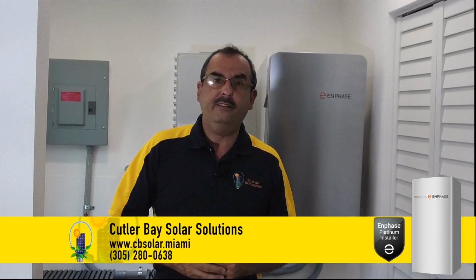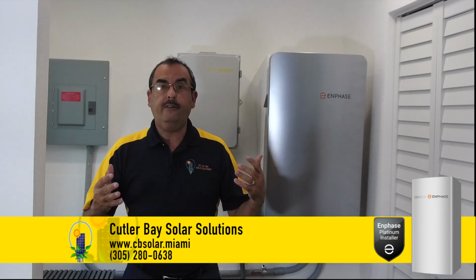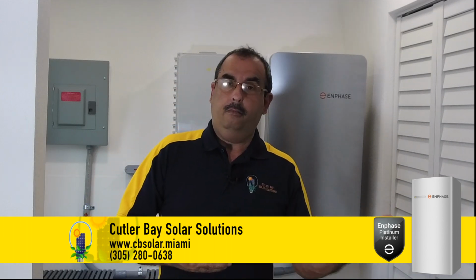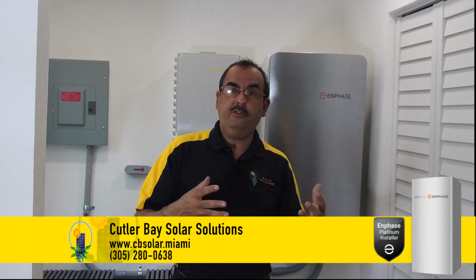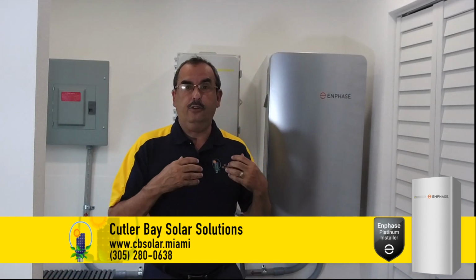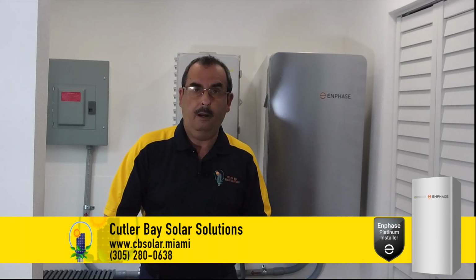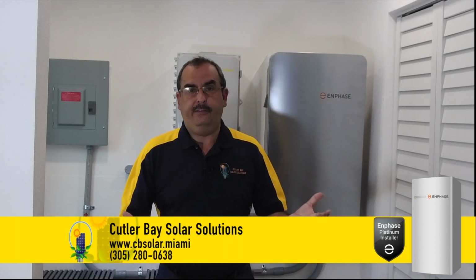These are two amazing systems. Let's get right into the first difference between them. And the first difference between them is the way that they are cooling. The Tesla PowerWall 2 has mechanical cooling. They have fans to maintain the chemistry, and those fans have to be powered in order to cool down the battery. While the Enphase Ensemble is passive cooling.